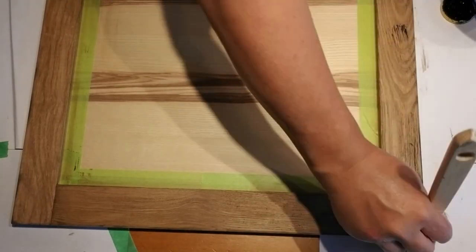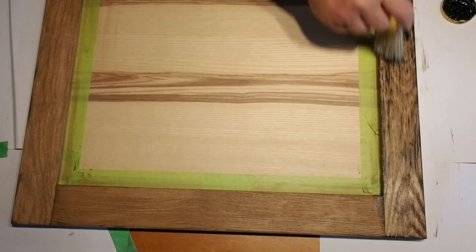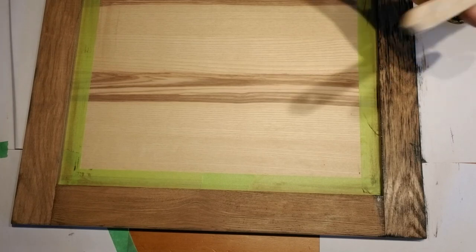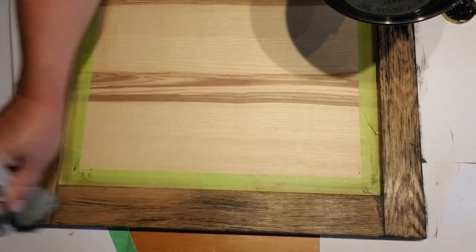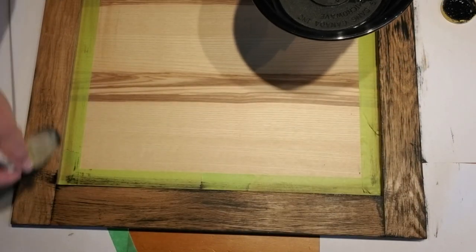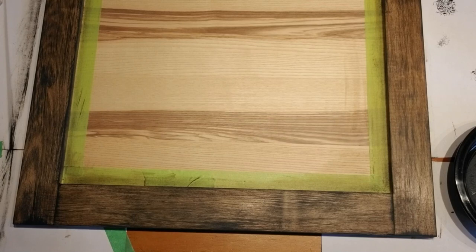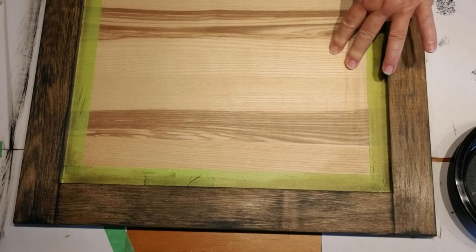I love how this has turned out with two coats of wax, but I want a little bit of a deeper color still. So I'm going to use some black chalk paint and give it some dry brushing just to bring out a little more richness. Dry brushing is easy to do if you've got the right tools. The brush had a little bit of dampness to it, but that's okay — I was able to blend it in with the dark wax and the result was just beautiful.